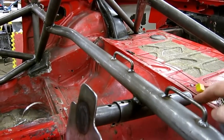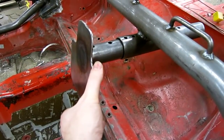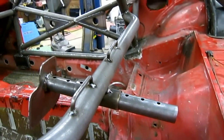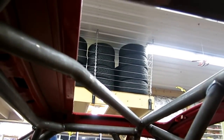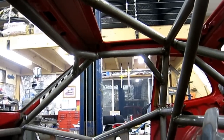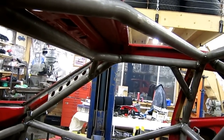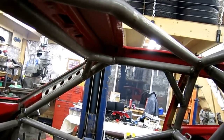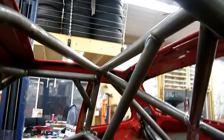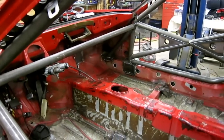I've put in these little straps for the harnesses — that's a good idea. I've also made a seat back brace that, with a plunger pin, is adjustable, so I think that will work well. That's about it for the cage. It's got a roof diagonal, though I'm not sure what the best choice is up there. I've seen cars with a V-shape coming from the center of the windshield bar to each of the rear nodes — that's probably better. I wanted clear space up there for tall drivers' helmets, as I have a few tall drivers on the team.